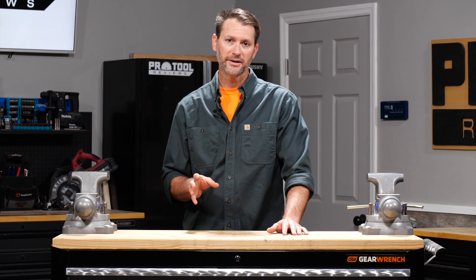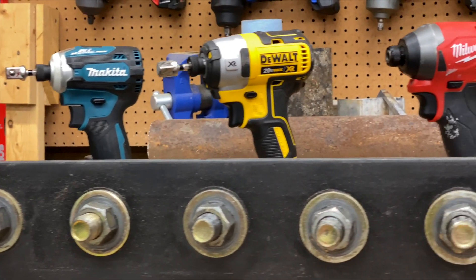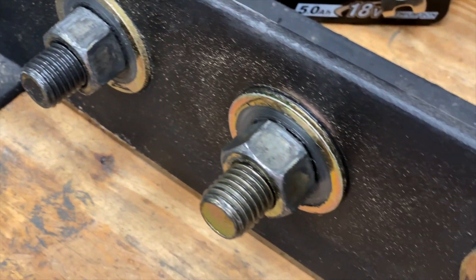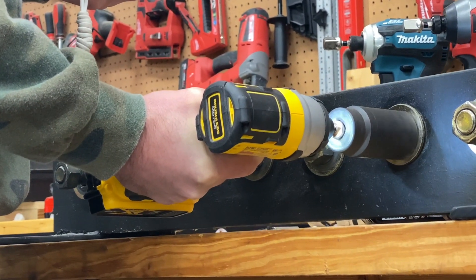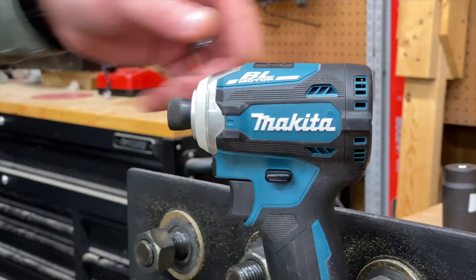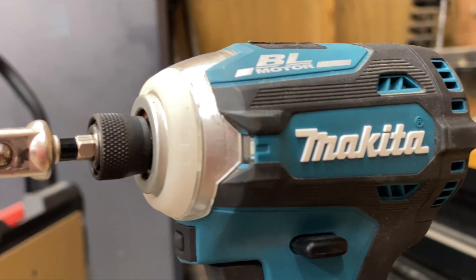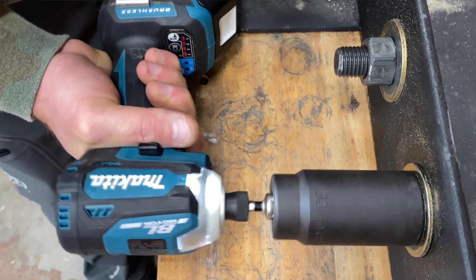Let's start by taking a quick look at our test rig. We weld grade 8 hardened bolts onto angle iron, and we're going to be fastening matching grade 8 hardened nuts onto it. All told, our rig can handle up to 500 foot-pounds of torque before the threads begin to fail — that's 6,000 inch-pounds — and we're pretty sure none of these impact drivers will come too close to that. To fit a socket this big, we need a half-inch square drive adapter, and we're using Makita's XPS adapters. Makita designs these specifically for high-torque impact drivers, and we've had good success with them, though this hard-stop test will be a good challenge for them.